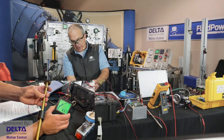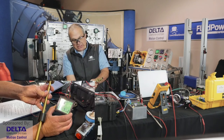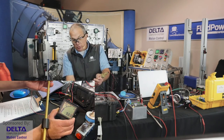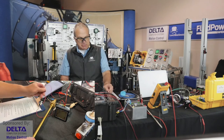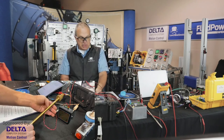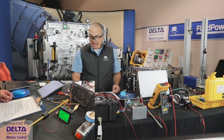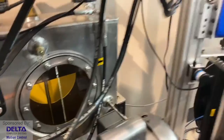It's a very lightweight float, but there's a small magnet on the inside of that float, and that's what's triggering those reed switches inside that tube at about a 1/4 inch resolution, and that is actually quite good. Reed switches aren't the only technology out there for sensing tank levels. Sometimes it's magnetostriction, like the kind we're going to see on position sensors. Sometimes it's even ultrasonic or even radar-based. But this is a simple application to get a good range of analog signals, and the reed switch assembly gets it done. As you can see, we deploy that ourselves on the top of our tank.